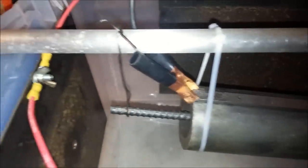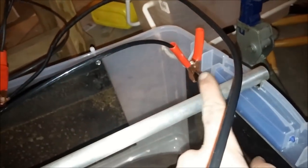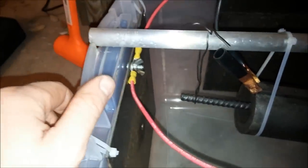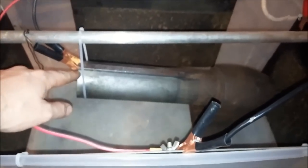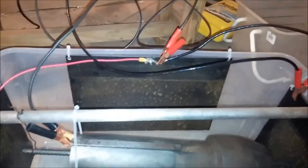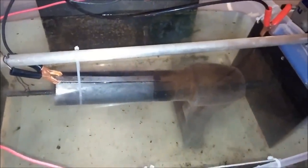I've changed it up a little bit because my rebar was too short, so I had to jerry-rig it. It's still attached to the plate, and this plate is running 5 volts. So this plate and the rebar are going to be 5 volts — it's not connected to the other plate. This plate and the other one are going to be 12 volts. I'm just going to connect the piece right here and the water level will go to just below that. We've got about 6.5 amps on the 12-volt line and about half an amp on the 5-volt line — a total of about 7 amps. Not too shabby, I'm pretty happy with that.